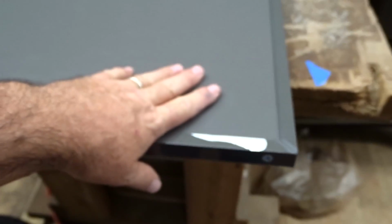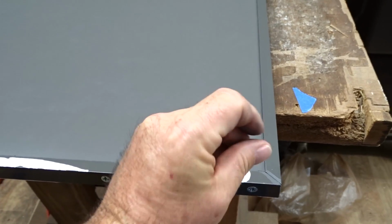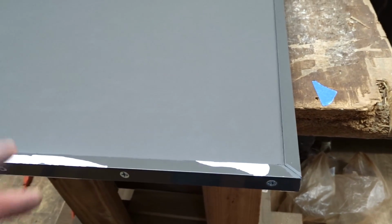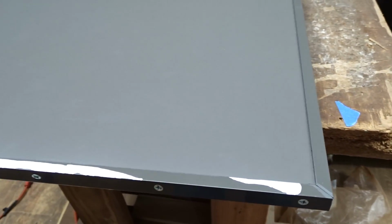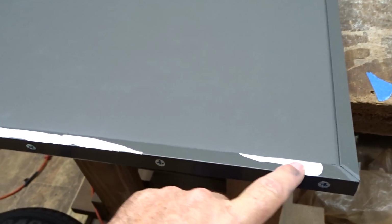But, so anyway, when I caulked, I taped everything off. I taped here, and I taped right there, just leaving a little tiny gap for the caulk. And then I covered all this with Visqueen. So, like 30 minutes to an hour after I had caulked, I went to remove my painter's tape. So I removed everything from here. It went great. But it wasn't until I started removing the painter's tape from the edge of here that it started taking the paint with it.